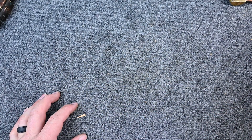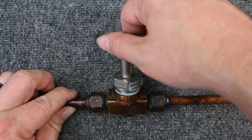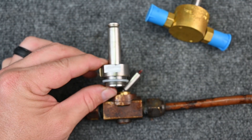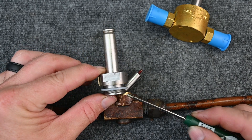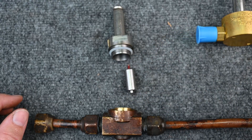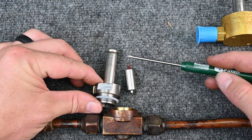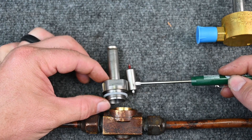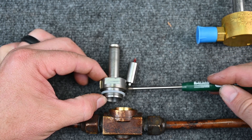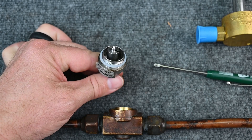That's how it works in its simplest form, but there's a little bit more to it. Let's open this up and see. There are lots of moving parts. We have a seal that, when it closes down, helps seal the two pieces together so we don't lose refrigerant. Then we have this pin, which is what moves from the magnet. There's a little spring pushing down against the top side, and the magnet overcomes the spring and pulls this pin up.